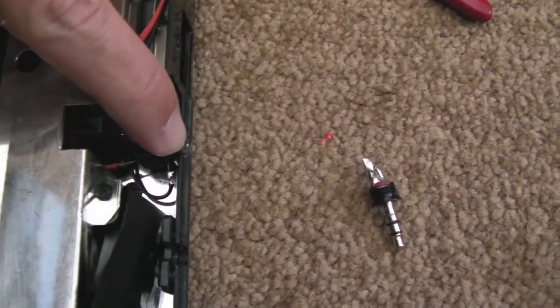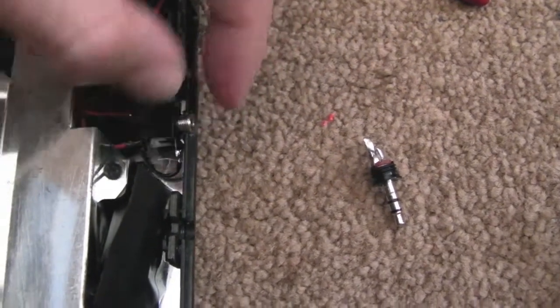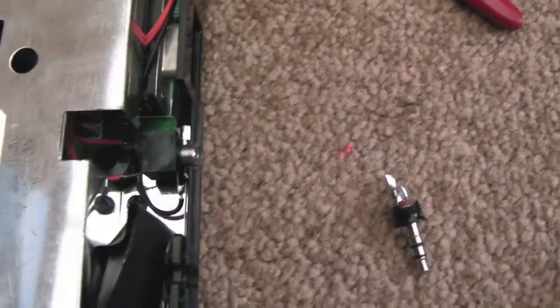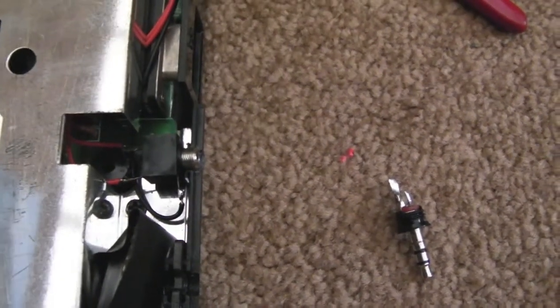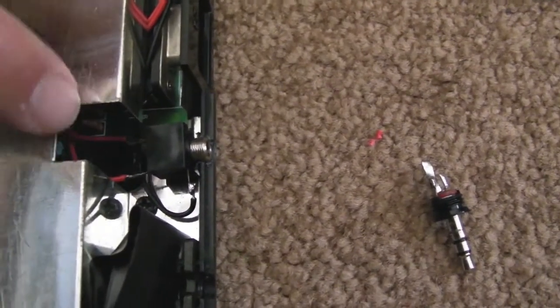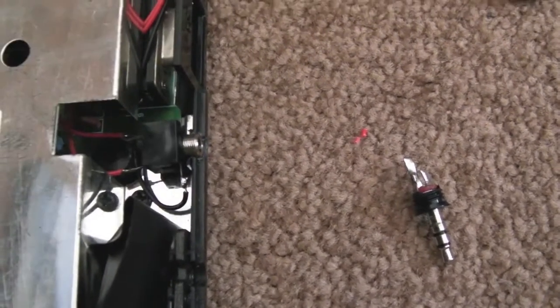The final thing I'm just doing now is adding a 3.5mm audio jack. Unfortunately, the position I've decided to mount it, there's not enough clearance because of the thickness of the case — I can't get it far enough out of the edge to be able to put the nut on. So I think what I'm going to do is just bend those wires around the side of that post and put some hot glue under and around it to hold it in place.